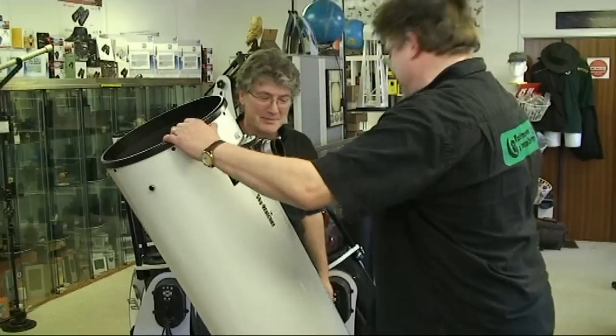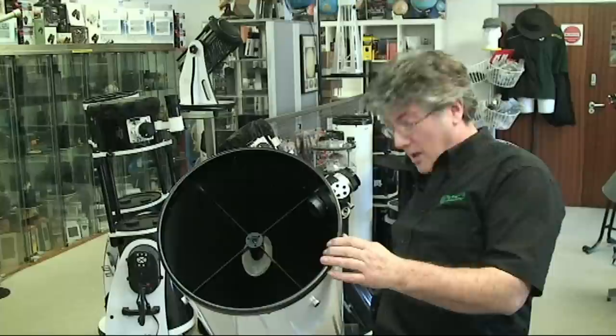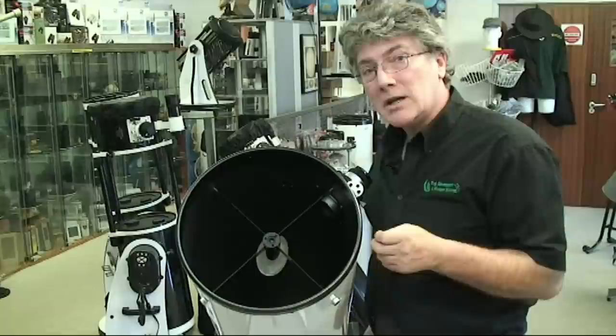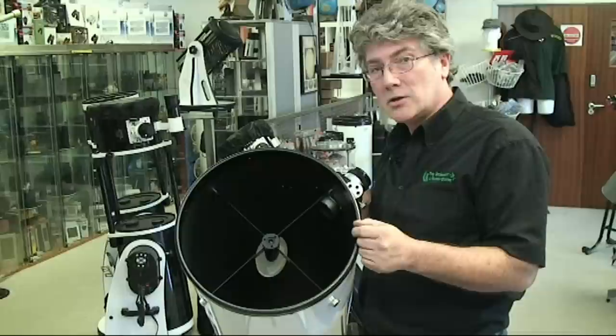Now Rob's finished butchering this Newtonian telescope, and it is a real mess. I'm now going to correct all the mirror alignment using the Allen key that comes supplied with the telescope and a Phillips screwdriver. The first and most important thing is to actually get the secondary mirror in line with the primary mirror. For that, we're going to do a shortcut and use a laser first, because the secondary is so far out I'm going to have to twist it to get it to line up right.